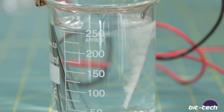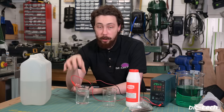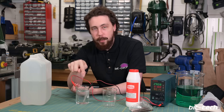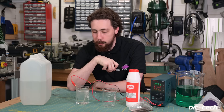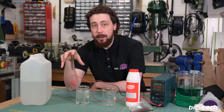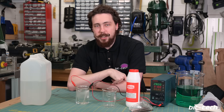You'll notice the moment you switch it on there'll be loads of hydrogen forming on the cathode - you can collect that and do the squeaky pop test if you like. Just bear in mind you don't want to pump a lot of hydrogen into a tiny enclosed space as it's very flammable, but realistically you're not going to be producing enough to cause any damaging consequences. Now all we need to do is let it do its thing.